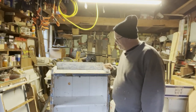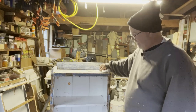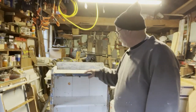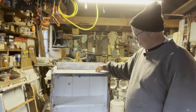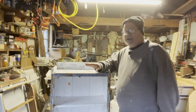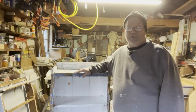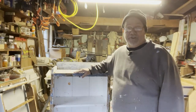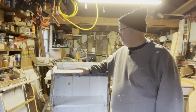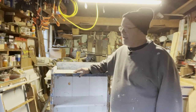It's a pretty nicely constructed piece. I'm not sure how old it is. I can't see any of the usual telltale signs, like what fasteners were used. It appears to be pine, just based on the weight and the color of the wood from what I've been able to see so far. The carcass needs to be stripped. It was oil-based paint and it appears to be exterior house paint. It all cracked off because the surface underneath wasn't prepared right. I started chipping away at it and then realized I might as well just attempt to strip as much of it off as I can.